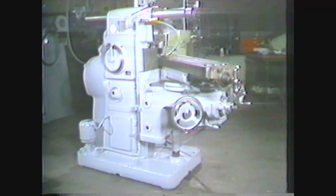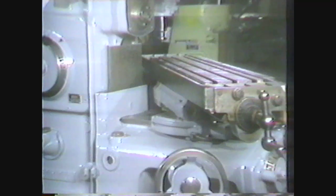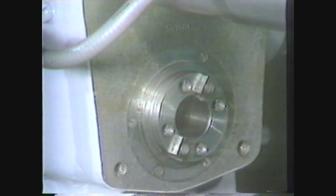The casting is generally hollow with heavy walls, leaving space inside for elements such as the main drive motor and coolant reservoir. Precision machine ways on the front face of the column allow the knee to move up and down. The column also holds the controls for operating the machine.